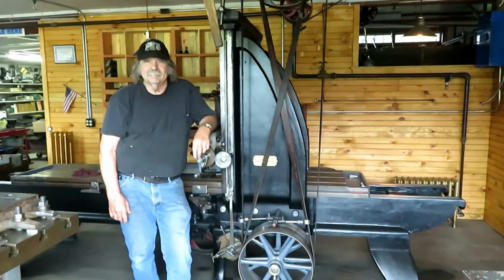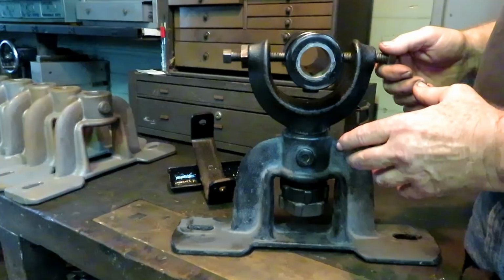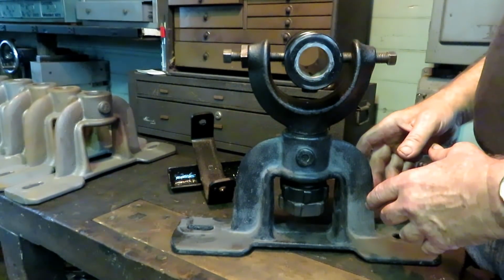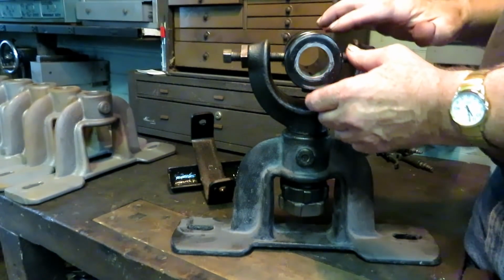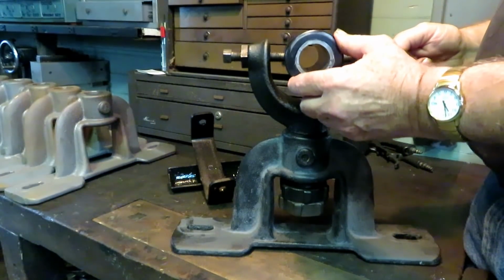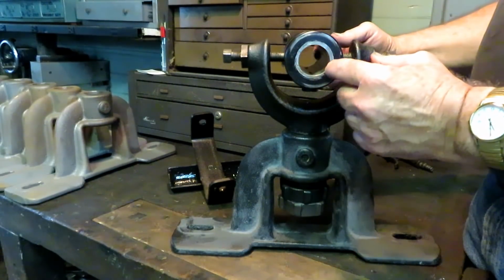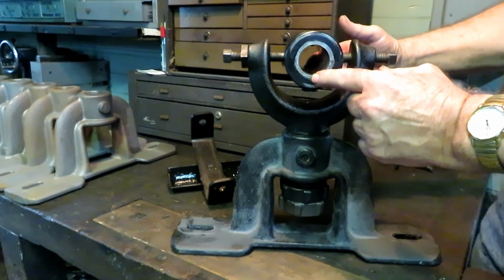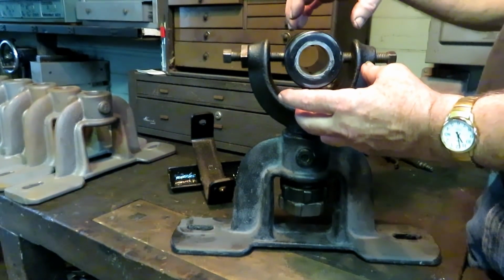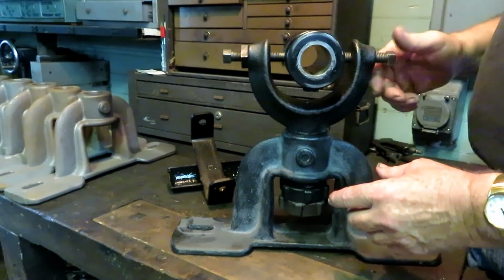This is the hanger from over the hacksaw that I took down and sent out for them to use as a pattern. The bearing part of it is not part of the casting process. I made this one out of one piece of steel and then poured the Babbitt bearing in it because I didn't like the way the two-piece thing bolted together. I'm not exactly sure how I'm going to do it on these 5 here, but that's what it looks like.